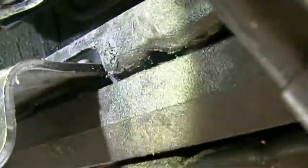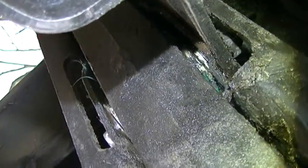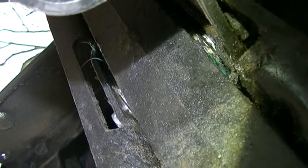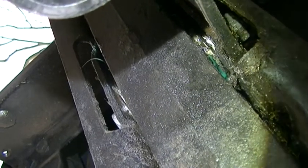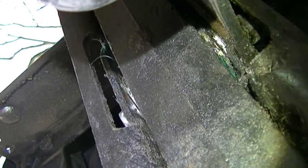Now on the back one, it's even harder to see. You can see the bushing. Needless to say, it's hard to see because I've got the bracket back in. So, like the front, you have a bushing — that's the one that's towards the axle. And then you have a spacer washer, which is between the bushing and the axle housing, which is how the axle's mounted in there. And it's difficult to see because of that bracket that holds the front of your deck up.